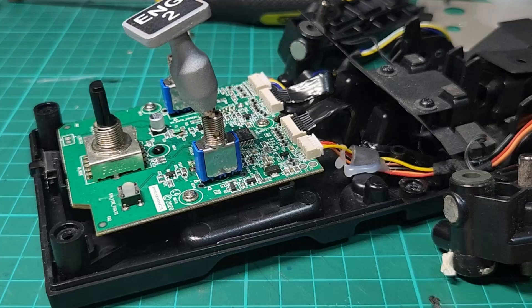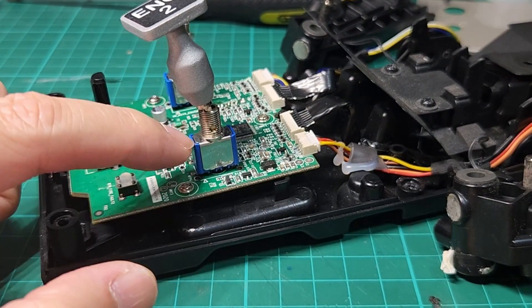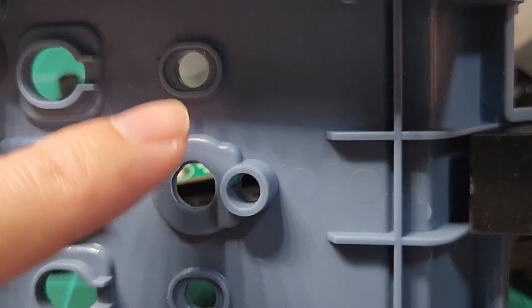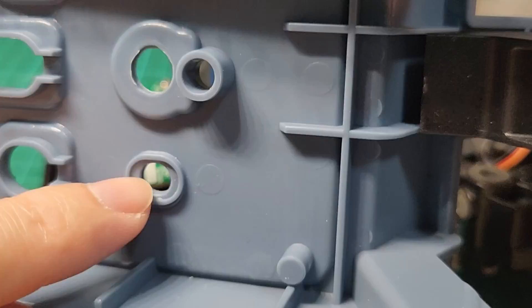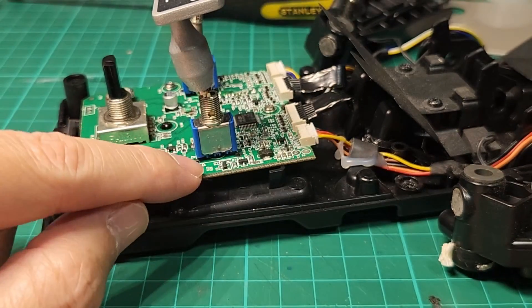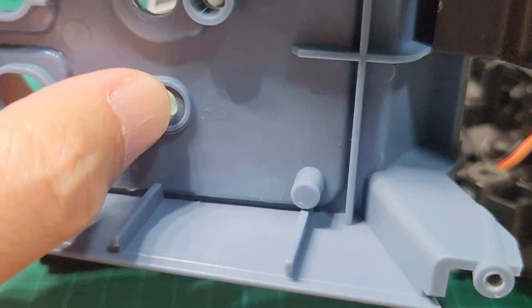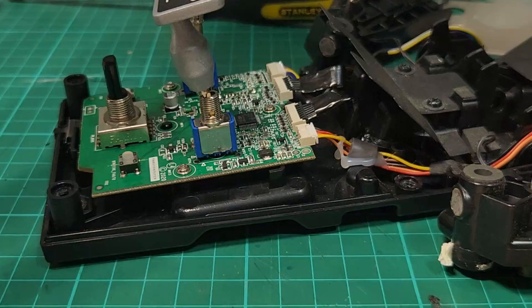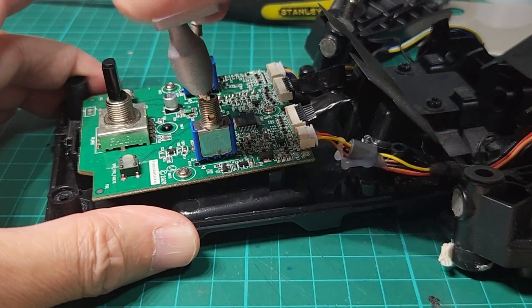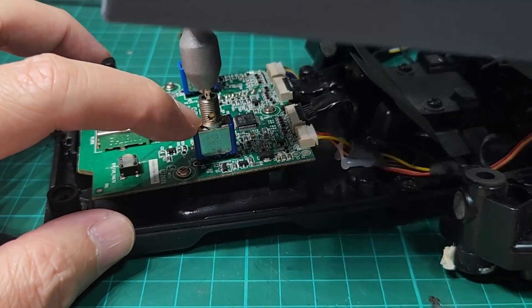With this kind of switch, which is taller than the original, the top of the switch actually hits the ceiling of the enclosure cover. That helps the switch stay in place and also transfers the stress point from the pins onto the ceiling of the cover, so each time you pull the switch the stress point is pushing against the cover.